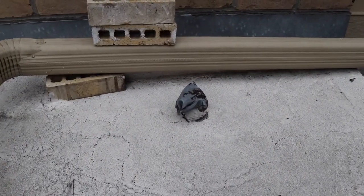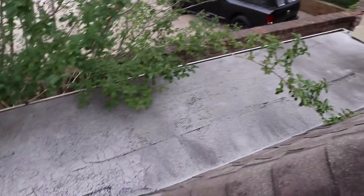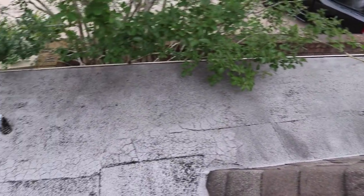I like how they took care of this plumbing stack — that's a funny one. You always want to make sure all trees are trimmed away from the roof structure. I was able to make it up this pitch because the roof is flat. I'll take some pictures from my small digital camera. It just shows you more reasons why it's always good to get up to the top of the roof or drone it — you want to see every portion of the roof you can, because this portion has some serious damage on it.